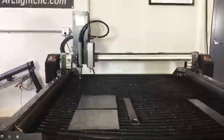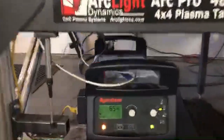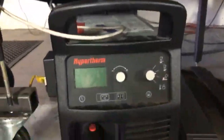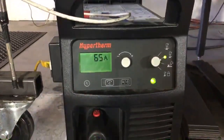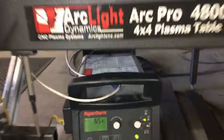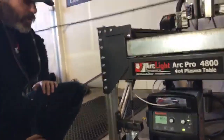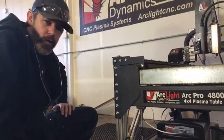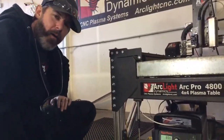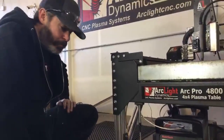And of course, since we removed our retaining cap, we've got an 050 code here on our plasma cutter. So I'm going to go ahead and reach back here to my power switch, off, then on again. And we've reset our plasma cutter. Teachers, you'll probably want to teach your students to turn the plasma cutter off first, and then change your consumables out, and then turn the plasma cutter back on. That's going to be your safer route.